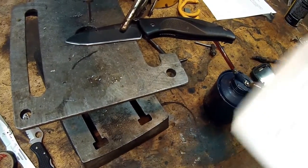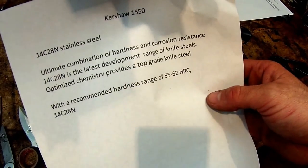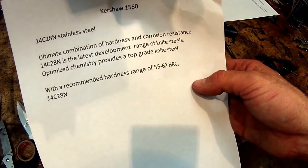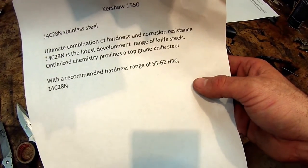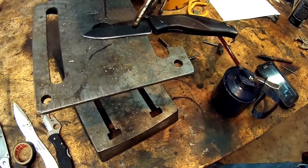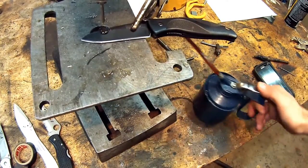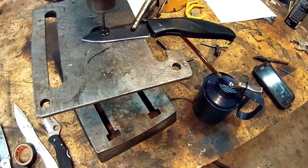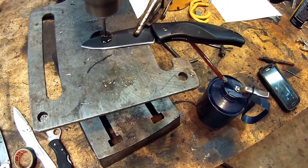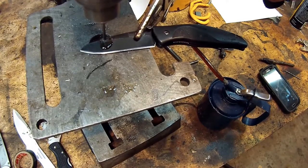Today we're going over drill bits and knife steel. This is a Kershaw 1550 with 14C28N steel from Ken Onion — a great, great steel rated 55 to 62 HRC on the Rockwell hardness scale. Really, really hard steel, hard to deal with and work with, but it holds an edge really nicely. These are solid carbide bits that actually have a sharp edge — a 144-degree split point — and it allows you to start working these kinds of hard and super steels.